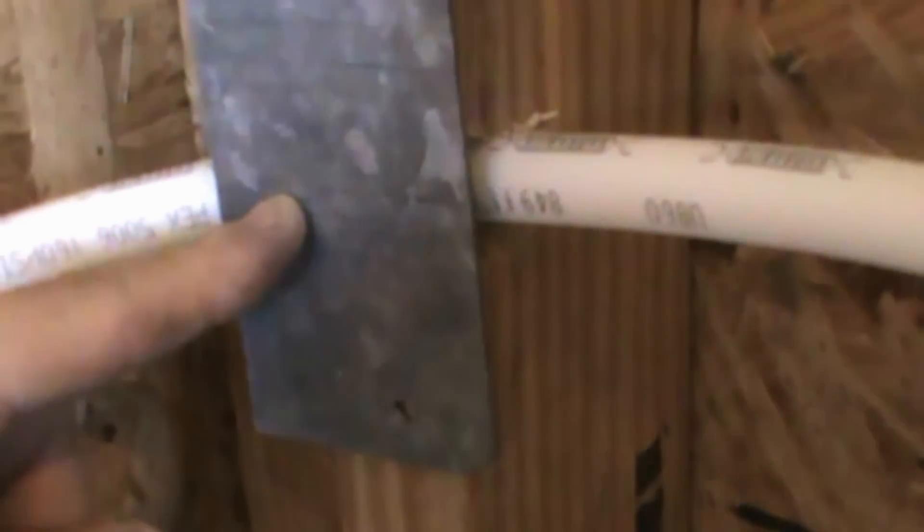I got a hole in that wall right there — that's a spigot so we're going to tie into that. That connection needs to be sweated so we're going to go from PEX to copper. This last hole I ran the PEX down the stud and as you can see in this stud bay it's really tight. I'm right in the corner of the shed and I couldn't get my drill in there, so I actually face-drilled this with a Forstner bit. Right here is where my water is on the outside — that's the spigot. I'm going to put a metal plate here to protect the water pipe and also hold it in place, and just screw that on with some drywall screws.